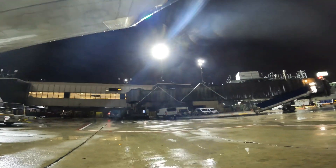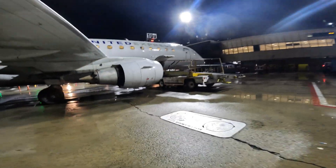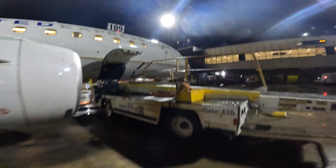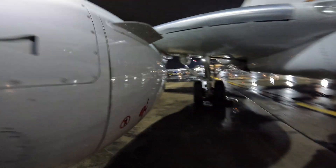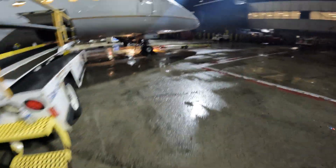Here again, just going over the fuselage, looking for signs of damage on the skin. Over here we're going to the fan blades of the actual engine. On the blades, we're just checking that there are no nicks, no dents, making sure everything looks good. These blades spin at a very high speed, so we want to make sure there's no type of damage — no kinks, no nicks, no cracks — because that can be very, very bad.